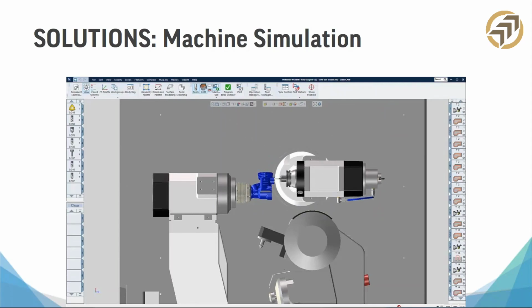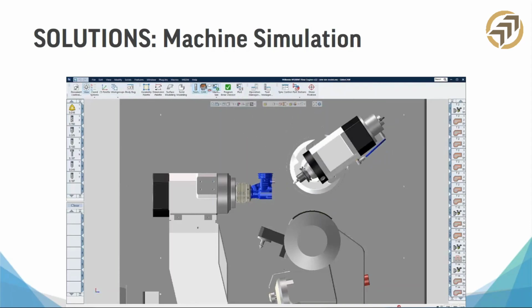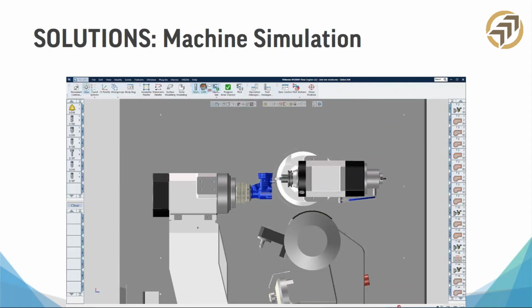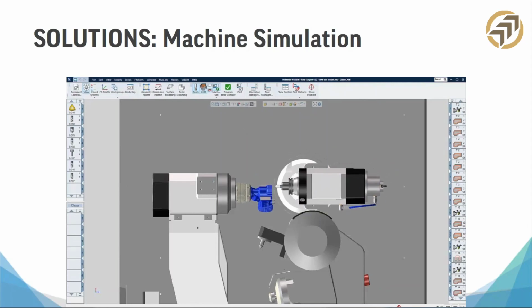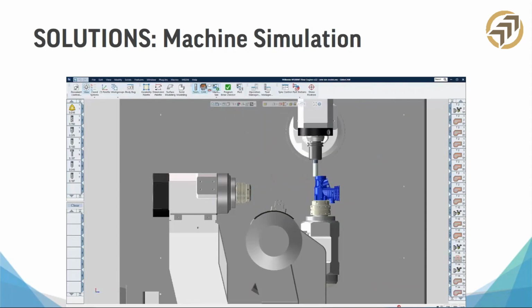So, maybe you want to come into a part and close the chuck with a tool in the B-axis. Maybe you want to clamp the part or transfer the part after the tool change. There's little things like this. You can imagine that the sky's the limit with these. When do you want to transfer the part? When do you want to cut this certain feature? This is what the sync manager does, and this is what machine simulation proves out.